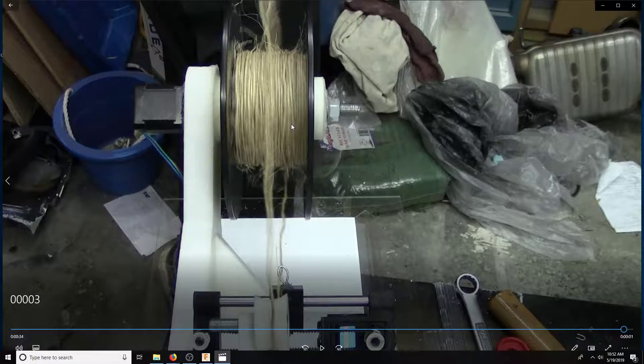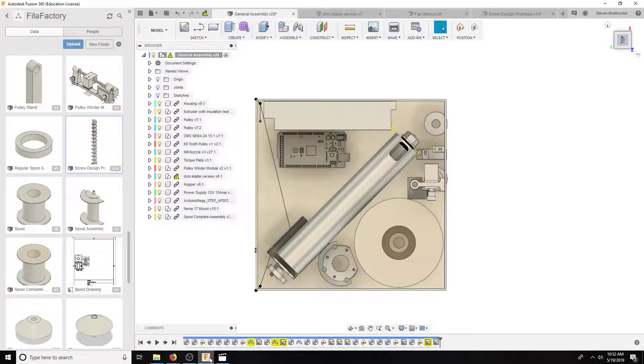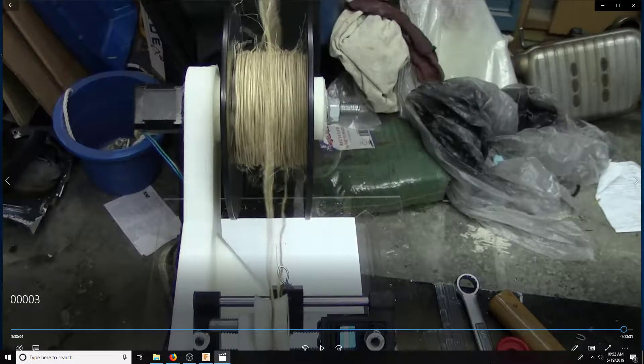The filament is a little more rigid than twine, but it does show that you can indeed pull because we are pulling with some tension and it is pulling here. This is going to have some gearing ratio to it, geared to the pulley, so we'll get quite a bit more force as well. This is likely the first time it's ever been tried — not using rollers to pull before it gets wound onto the spool, instead using the spool itself and eliminating an entire extra module. That eliminates a whole other stepper motor, stepper driver, and space.